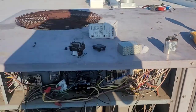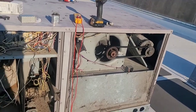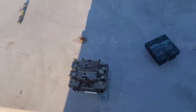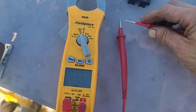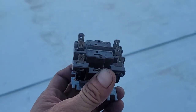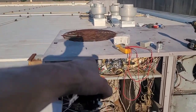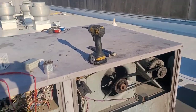Alright, we've got our new capacitor in, we've got our new relay in, and we're ready to apply power. That's very nice right there. I bet the contact points on the old relay were stuck or pitted badly — either way it was done and needed to be replaced. It works now — no more problems out of this. The compressor lockout is okay; it locked out because of what was going on over here with the bad relay.